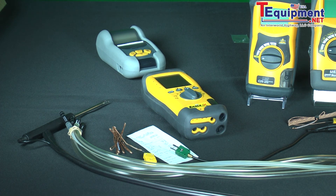With the second thermocouple you measure the incoming combustion air temperature — the air coming in from outside — because the efficiency is calculated on the difference in temperature between the incoming air and the temperature of the stack gas.